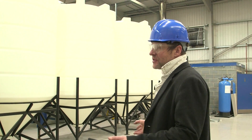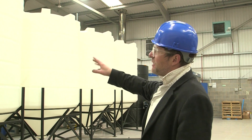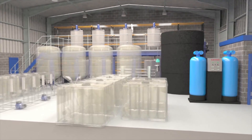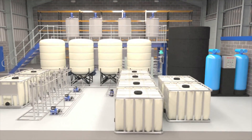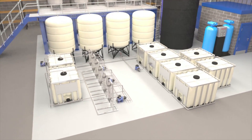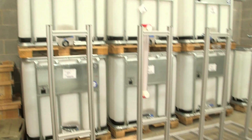We then collect the products in these huge tanks. We're collecting the raw product, which is okay for some things, but we need to process them in other cases. These tanks will hold maybe an hour's worth of product flow - we've gone from maybe a litre an hour to maybe four cubic metres an hour, so that's a pretty big scale up. These will hold process fluids for then processing and sending off, and they will probably be the final stage - once they're in those tanks, they're probably product.